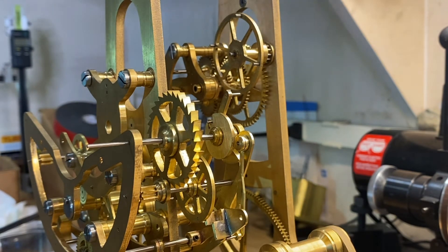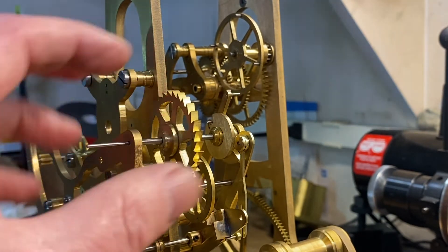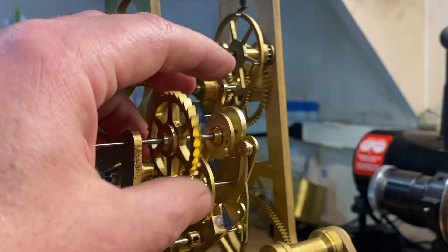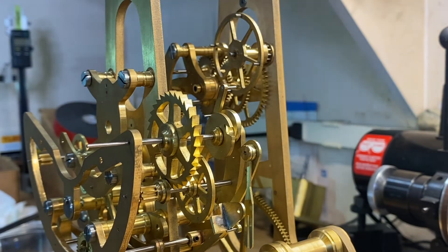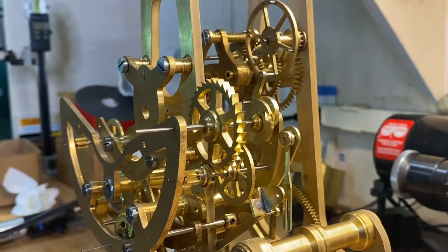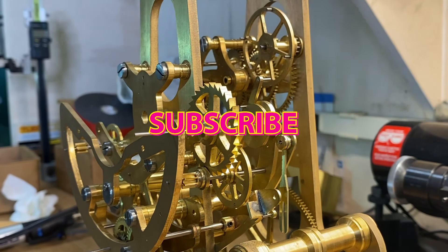That's the trick. What I've got to do now — I've got a lot left. I've got to build the detent because right now this doesn't want to stay in any one day, it's loose. It's got to be indexed so every day has a click and it can't just float. We've also got to get the drive weights on this. But it's a lot of fun — I think it's gonna get more straightforward now that I've finally figured it out. In the process you can see I made a lot of scrap parts — there was a lot of fitting and figuring. Not right yet, but at least I know how it works. We'll get more of this and be back with you soon. Thanks, and please subscribe.